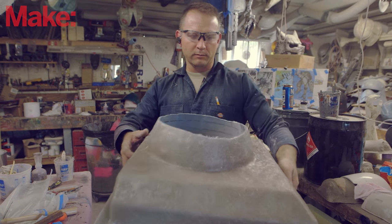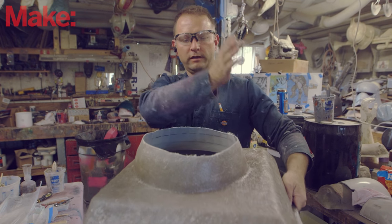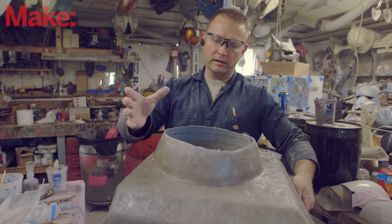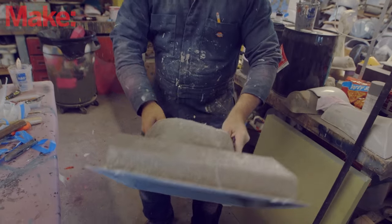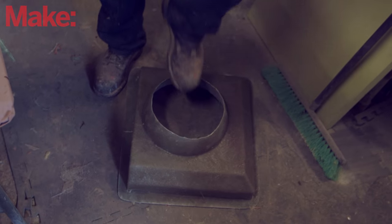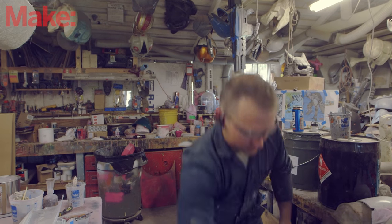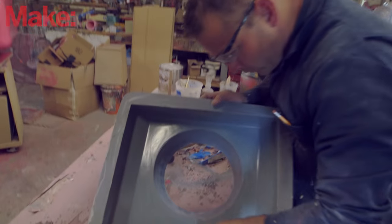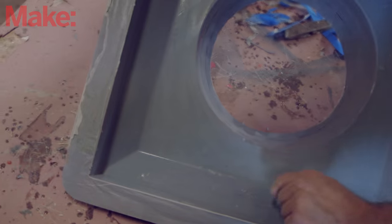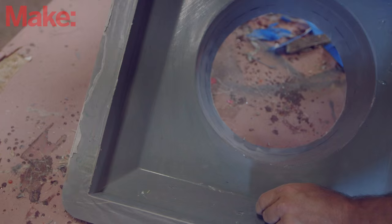It's not exactly the same shape as the part's going to be, but this portion of the bowl here is going to be what the shin piece rests on, so we'll have the possibility of an ankle that can move left, right, front, back as it angles, and it still has to be big enough for the wearer to put their foot in and get strapped into the character's foot. Now that we've got the mold, it's time to clean out the release agent from the inside, then sand it smooth, wax it, put a coat of PVA in there, and then lay up the part.